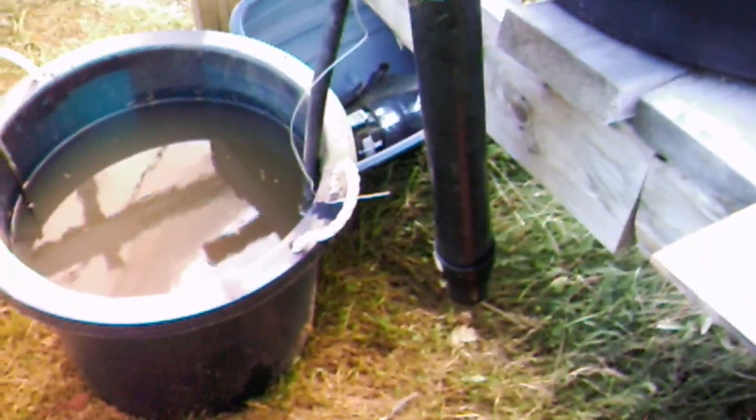It just gets slotted in the side. Then I take my other piece of elbow pipe and just push it on. So now you can see how this is going to fit there. Water comes down here, across, hits the back of the piece of plastic, moves from the up pressure side, sucks air down the pipe, injects it into the water column, and then it falls out the bottom. So I'm going to hook this into my simulator here, turn it on, and show you what it looks like.